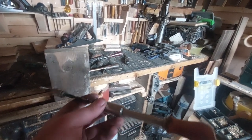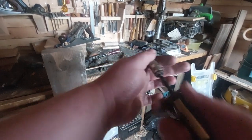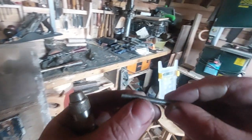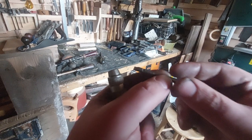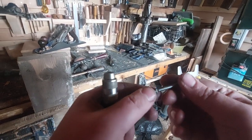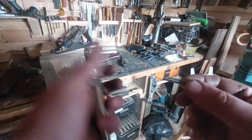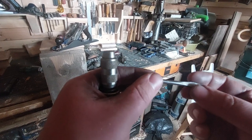It's quicker than using a hand screwdriver, although it's not as fast as using an impact driver or a drill. Now the problem with these old ones is the fitting — that's the shank. A modern hex bit, which most of us are familiar with, will not fit these, and the bits are more difficult to find than the screwdriver itself. There are a few different sizes as well.